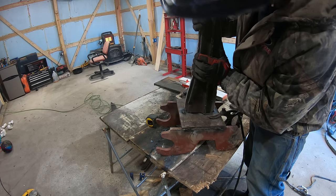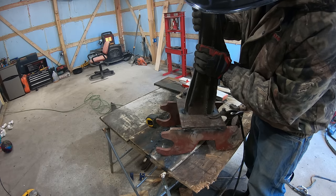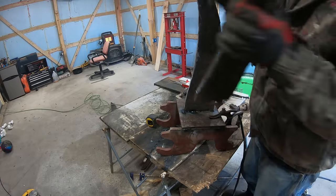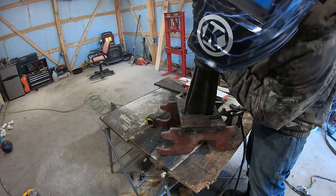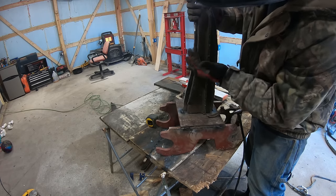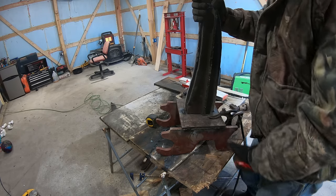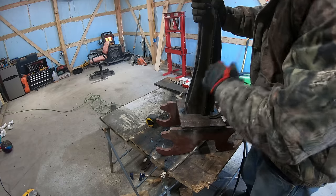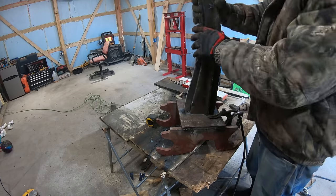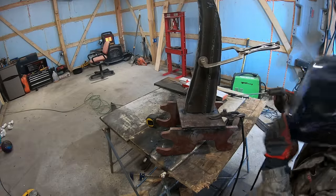just slightly so that there's a gap in there. Because otherwise I gotta grind down that weld, or I gotta grind down this side. So I'll just hold it up slightly. And then I can put a nice thick weld bead in there. And everywhere around, I'm gonna have a half an inch of space so I can weld in it. Otherwise, I'd have to bevel everything, and it's just a lot of work to do that. So again, I'm just gonna tack weld this.